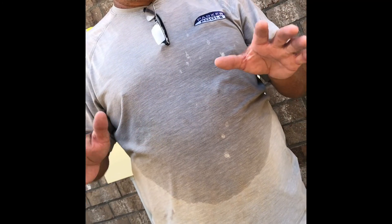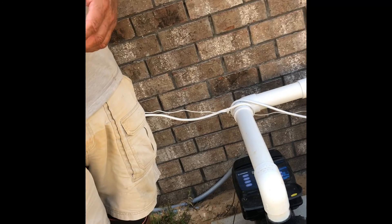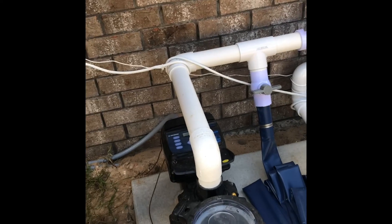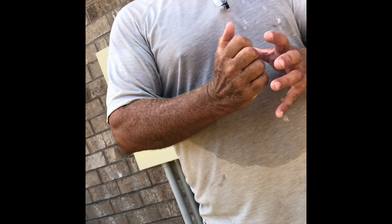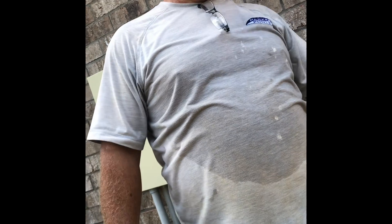When it comes wintertime, about two or three times a week I've got a little contraption. Because they call the office and need a service call because their skimmer's not pulling water anymore. And I have to go out there and hook up a contraption here and at your skimmer. I have a little plumber's helper, and I push it down in the pipe, it builds up pressure, and you'll see a geyser come out with leaves and everything. Because they accumulate in the pipe, and after a while they will clog your pipe up. And you guys have only got one skimmer.